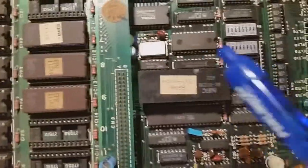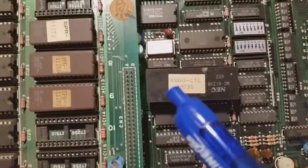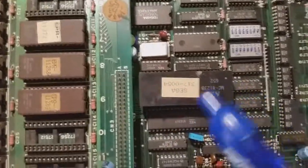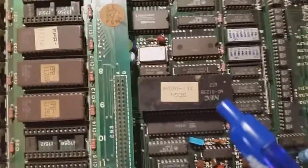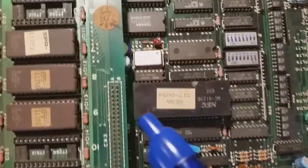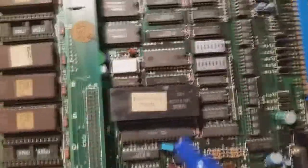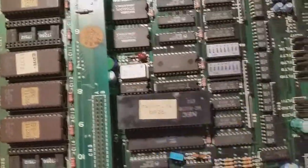Down here is the sound CPU, which is actually a Zilog Z80B, but this particular one is an encrypted module that's got a battery backup. When the battery dies, you have to do some fiddling around, but it's easily enough fixed just by replacing the CPU and one of the ROMs on the ROM board here when the battery dies.